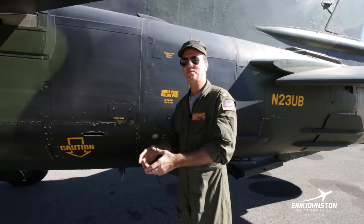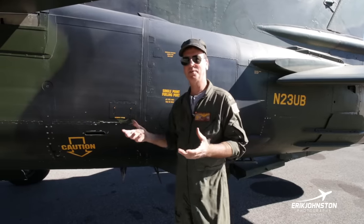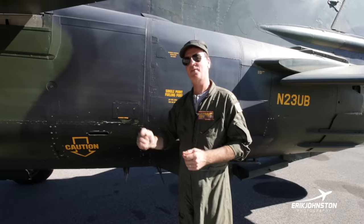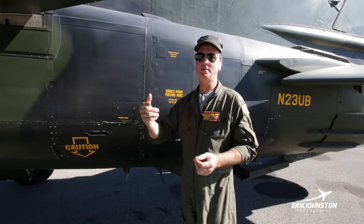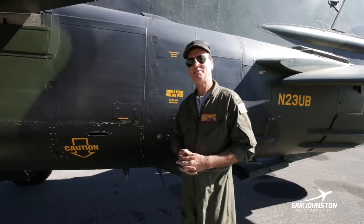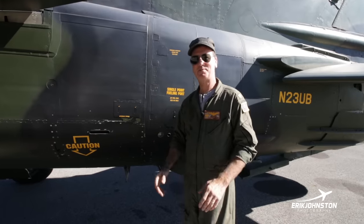So it doesn't have floats in it and say, ooh, you have this much fuel. You dial in. If I totally fuel the airplane, I know I have 4,000 liters in it, so I put 4,000 on the gauge, and it subtracts from there. And there's a series of lights that tell you, oh, your fourth tank is empty, your wings are empty. So you kind of keep track of how it's going, but it doesn't have a fuel gauge per se.